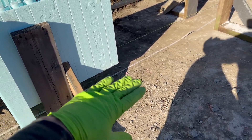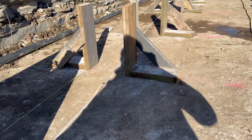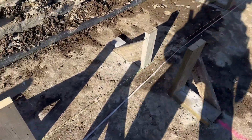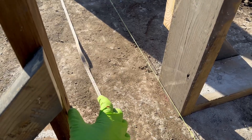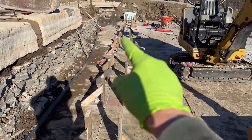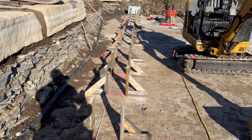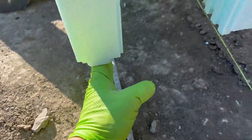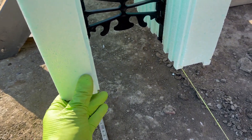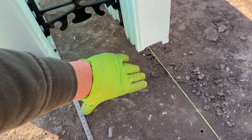My plan here — and I'll show you this as I do it — is I'm going to have 10-foot 2x4s or 2x6s, because I have to use them for the framing of my house anyway. I'll be able to keep them full length and I'm actually going to screw them to the inside here, so they'll be sitting in here. I'm going to use the laser level to get them perfectly level all the way along on both sides — a 2x4 or 2x6 going all the way down with the bottom of it exactly where I want the bottom of the ICF to be. Then I'll go ahead and stack it just like stacking ICF on a footing. You might be thinking — you're going to have a 2x4 right underneath your wall — but really it doesn't matter, because this is just insulating foam. The down forces of your wall come straight down the wall, six inches wide, right down, and they transfer the load right to the rock.